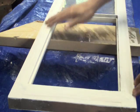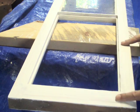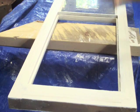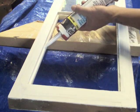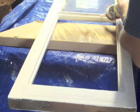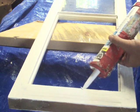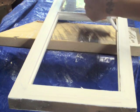We're going to put the glass in now. What I did is a knock-down sand and then gave it a coat of primer — keeping it simple. Since it's been primed and is moderately dry, we'll simply put a very thin bead of caulking in the corner where the glass is going. The only reason the caulking is going in here is not so much to seat and hold the glass as it is to guarantee there's no water penetration. Be very careful to make sure you get all the way around and create a perfect seal.